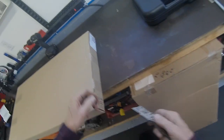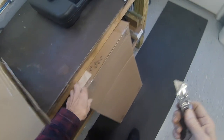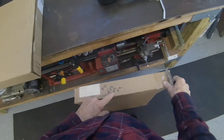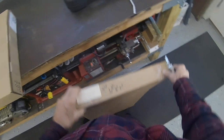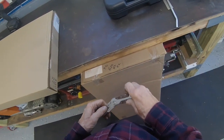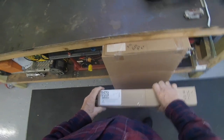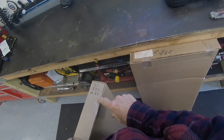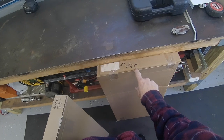All right, I want to just check this one thing. The heat exchanger for this model 650 refrigerator is supposed to be a 701-5918. I brought it with me just in case I needed it, but we were out of stock. I mean, I had one here, I didn't know it, but my other Sub-Zero supplier only had these in stock, and I was told that these are the same. 701-5724. Now this says 511 heat exchanger, 550, 511. This is the heat exchanger for the refrigerator compartment. This is a 650 heat exchanger.